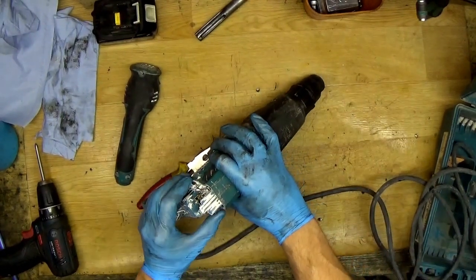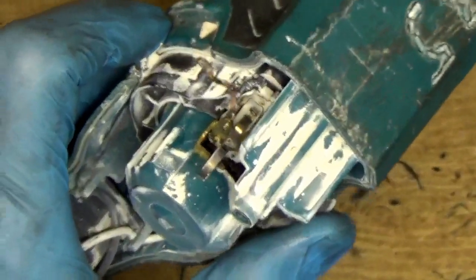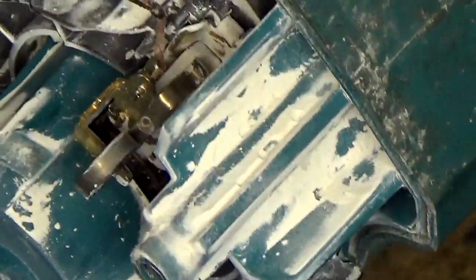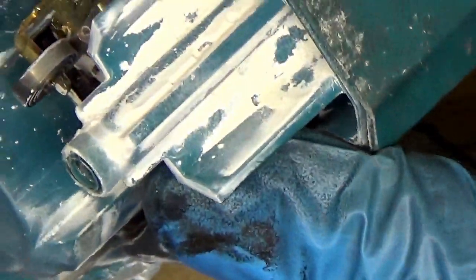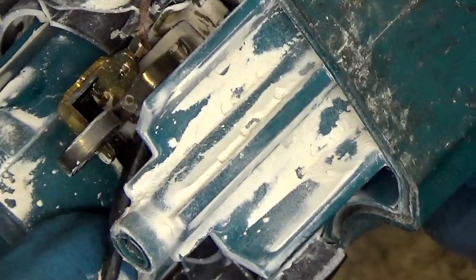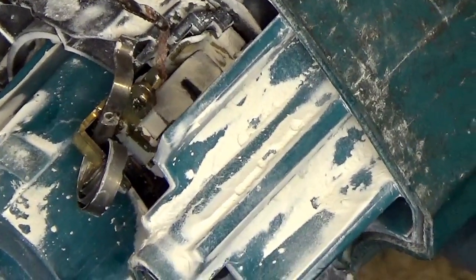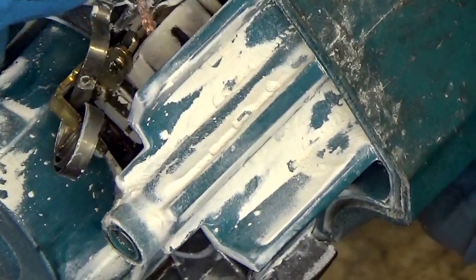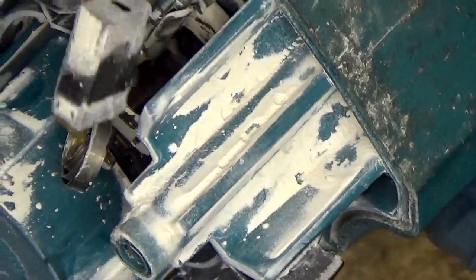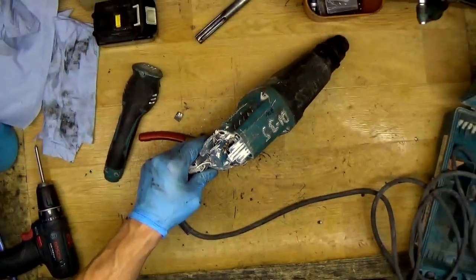So now it's the spring here. I'll try to zoom in. Okay, so it's a spring now. We'll try to do that by looking at the camera. Just lifting the spring and getting it here. As you can see now, the carbon brush can easily be taken out. This carbon brush is almost good. So the one carbon brush is out.